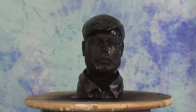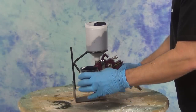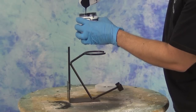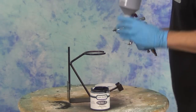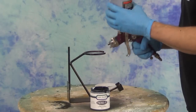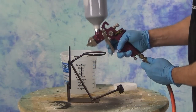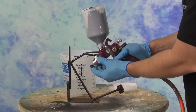Once we've applied our primer, we're ready to clean up our gun. This is not a tutorial on equipment maintenance, but just make sure anytime you're using a spray gun like this that as soon as you're done spraying, empty out what's left and run some clean water through — or whatever is the appropriate solvent for that material. In this case the metal coatings and the primer are both water-based, so here we're cleaning it out with just clean water. If necessary, take apart the gun, run plenty of water through it, and clean it completely before you're done with it for the day, otherwise you will destroy that spray gun.